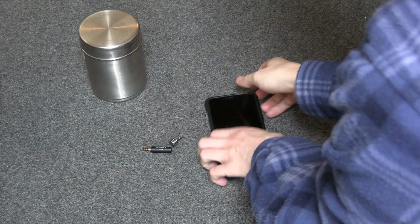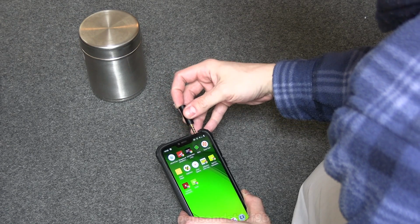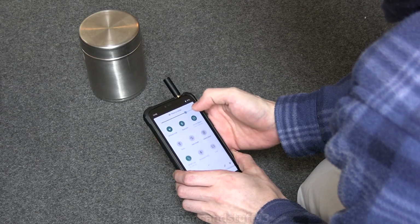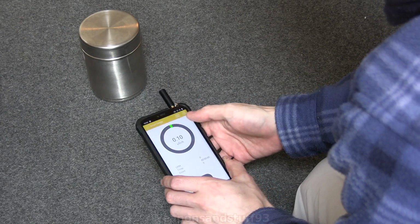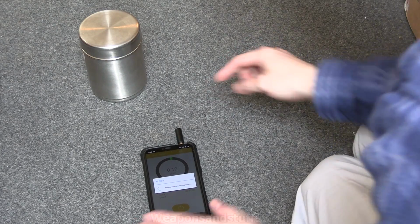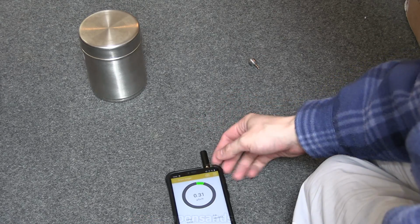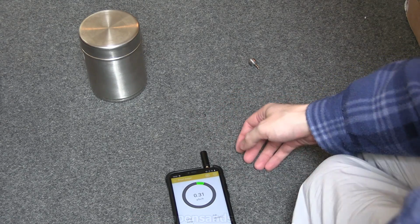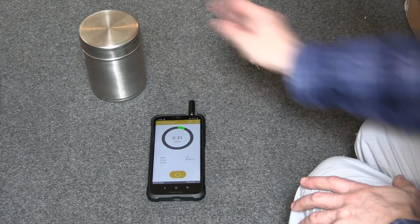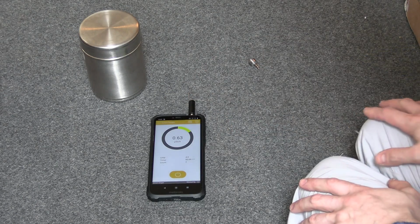good. So, if we plug the Geiger in first, that has its own app, which is this one, Smart Geiger. Now, what I need to do is turn the phone to aeroplane mode, because for some reason these never work very well when you haven't got the aeroplane mode on. I think it's because it can sometimes pick up Wi-Fi signals. So what I'll do is just try and get that there. Now, it will be above background radiation at the moment, because the phone knows that that's in there. So interestingly, these are advertised as gamma only, but they can detect beta, and I can demonstrate that